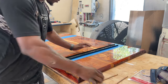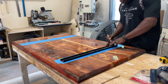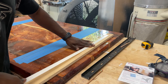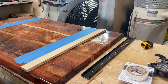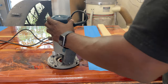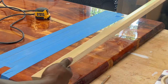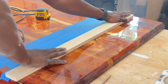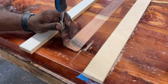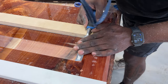Off camera we poured tabletop epoxy just to get a coat on the bottom. Now I'm routing out the grooves for the C-channels — these are steel C-channels from my local lumber yard — which will keep the slab flat for a long period of time, preventing bowing and cupping. What you saw me put below this piece of wood was a two-sided tape — that stuff is extremely durable, so if you need a temporary hold use double-sided tape instead of drilling into your material and having to fix holes. Then we used the Bosch router to route out that groove, and came back in with Rockler chisels to square out the curved edges for the C-channel.